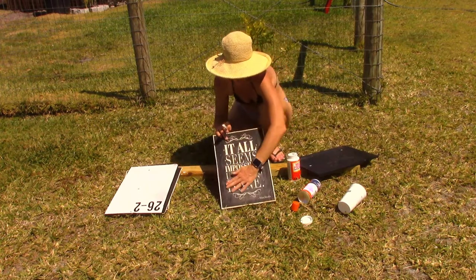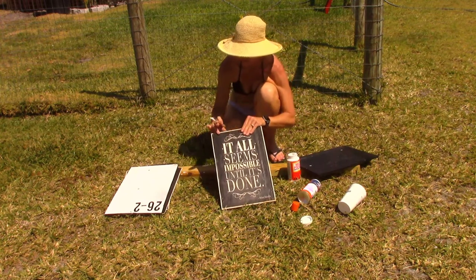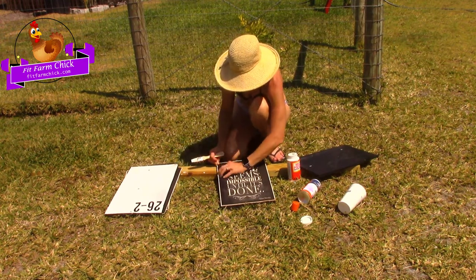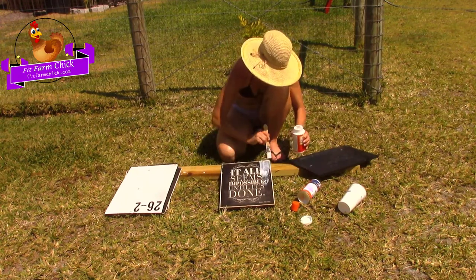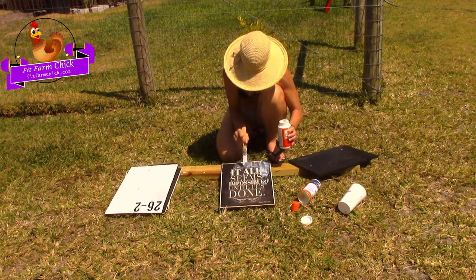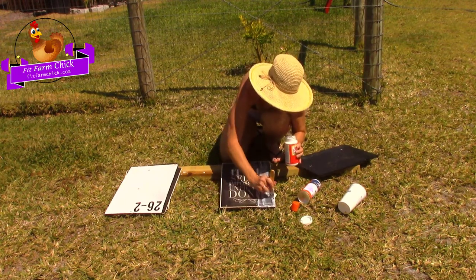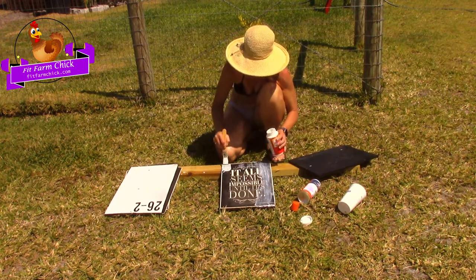Now that it's adhered, keep pushing all those bubbles out as best you can. You really want to go around the edge so there are no pieces that can peel off later. Go over it with a nice generous coat again, going with the grain, but always go towards the edges first — away like this — because you don't want to rub this way and peel it up. I'm giving it a little pressure, still pressing any air out.